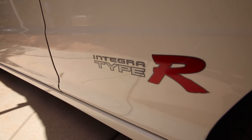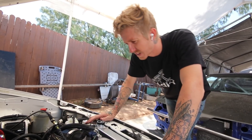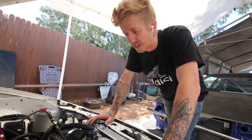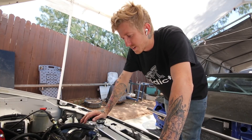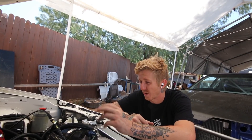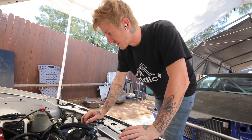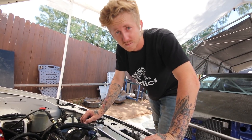What I'll be doing is pretty simple — just taking the intake off this one. It's a Hybrid Racing setup, pretty much the whole Hybrid Racing catalog. I'm going to pull this intake off and make a cold air intake for the guy in California, routing it straight down next to the frame rail. The hardest part will honestly be getting the existing one off since it goes up into the wheel well liner. I'm going to get the front end up, take that off, and get started.